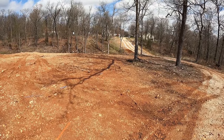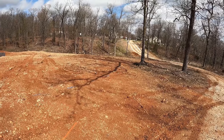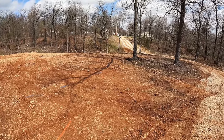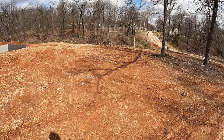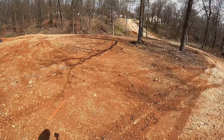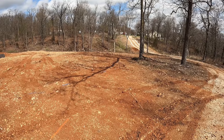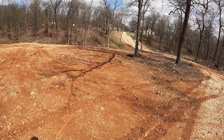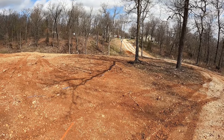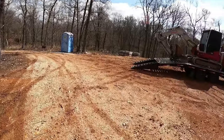I guess we're gonna put the pipe in. We're gonna do 1-inch PVC on both of them, because like I said, it's 400 feet long. So I got Dad on his way with some screening so we can bed the pipe in, because there's nothing but big rock over here. I think the price of PEX was just ridiculous, so we'll do two 1-inch schedule 40 PVC pipes. Now we'll put them in the same ditch, and then like I said, put, I don't know, 8 or 10 inches of screenings around them and kind of bed them in with that, and then we can backfill them and clean them up. So let's get to it.